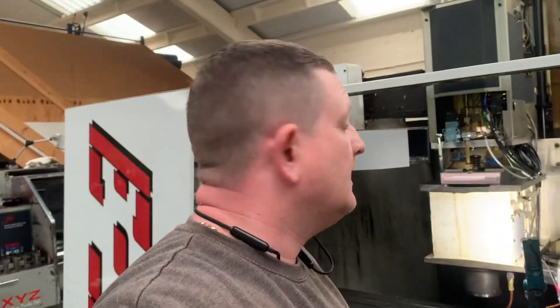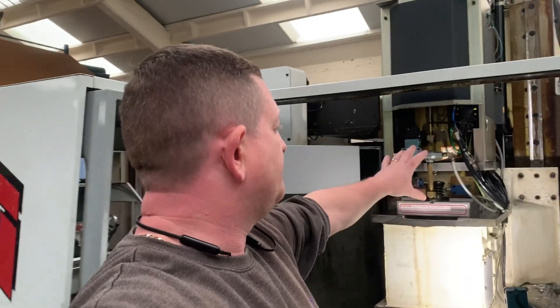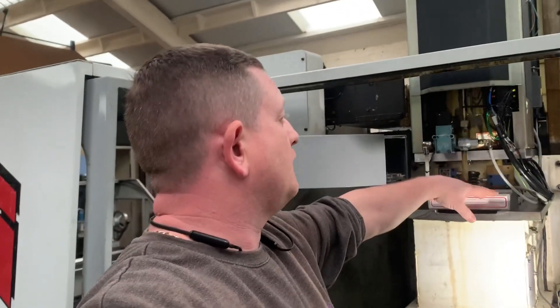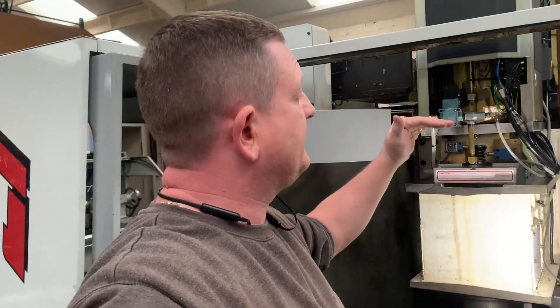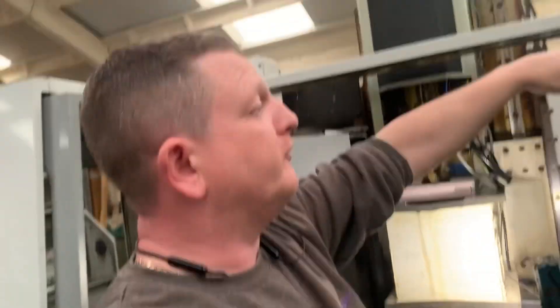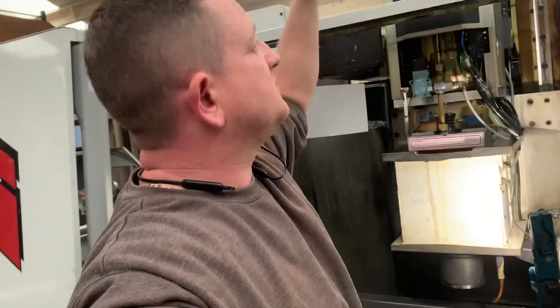So one way or another, it's got to come out. I did try to avoid it and was kind of happy it didn't have to be done, but there's no point lying to myself and putting the covers back on when I know this is an issue — I don't want to be in the middle of jobs when it starts causing problems. So I've bought all the bearings for the gearbox. I may not go into the actual gearbox itself — I'll take this off, disconnect the cables, and we'll lift the spindle motor and the gearbox as one unit. Luckily my landlord next door has a small forklift truck that will get in nicely behind the machine to lift it.